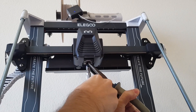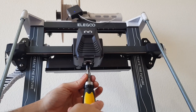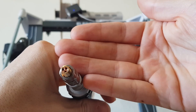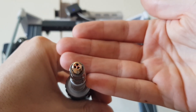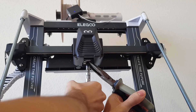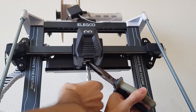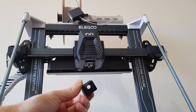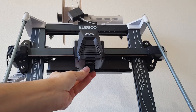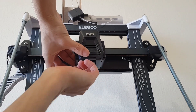Then hold the hot end straight with the pliers while you loosen the heated nozzle. Be careful, it is still very hot, and it's best to place it on a heat-resistant surface. Now you can insert the new one — it should be able to be screwed in without much resistance, and when you notice that the resistance increases, use the pliers again to grab the hot end while you finish screwing it in. Once this is done, you can reinstall the silicone protection cover, but only do this after you have switched off the printer and allowed it to cool down, otherwise you will burn your fingers.